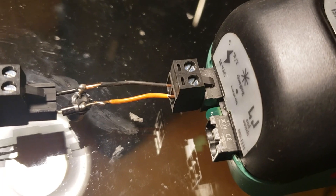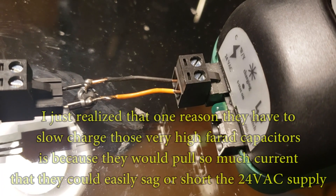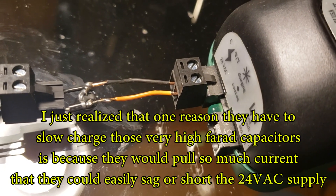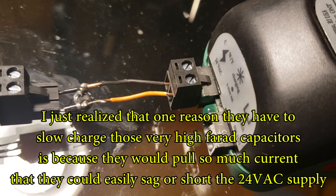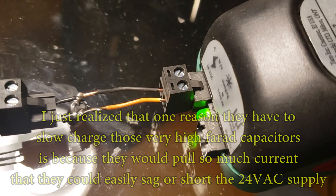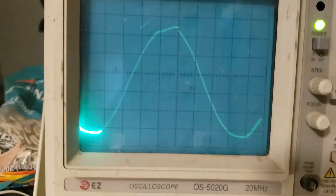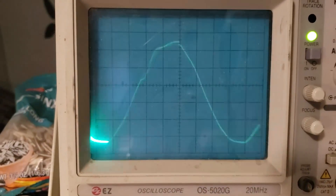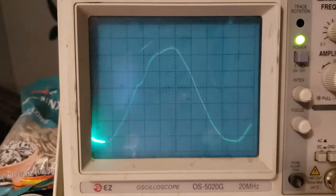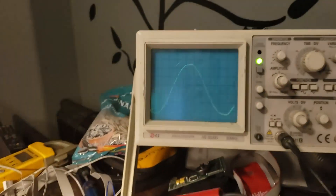It takes up to 30 seconds if it's been off for a while, because driving the motor backwards drains those capacitors. Those capacitors are huge — I think they're rated at six farads, which is pretty insane, and expensive. You hear a click when it's supposed to be driving the motor, but I broke this one taking it apart so you're not seeing it turn. Now you just get a little ripple every once in a while, whereas before you'd get a real big click every couple of seconds as it trickle-charged those capacitors after the valve drove open.